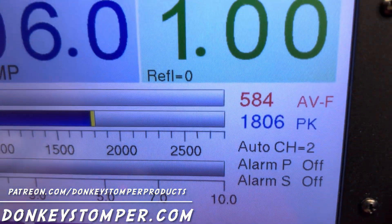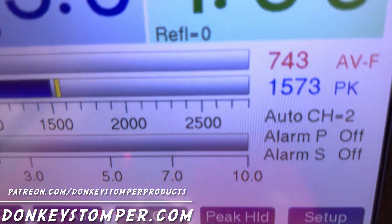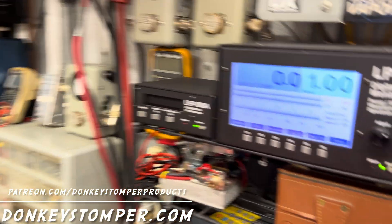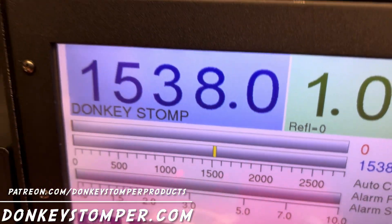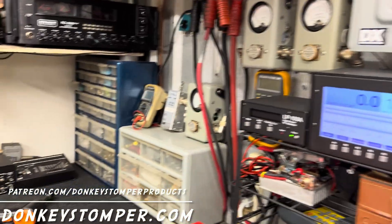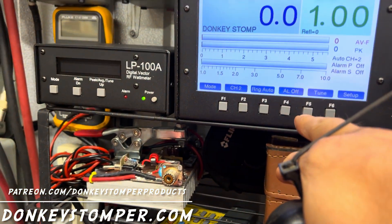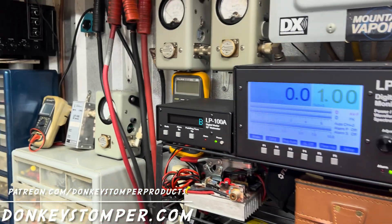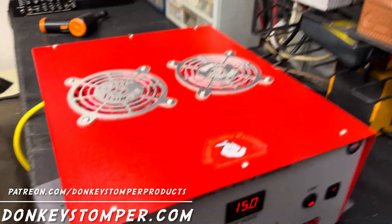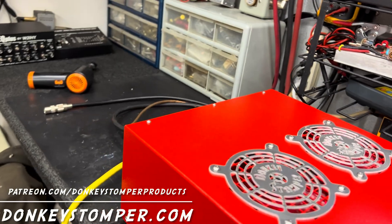So let's do it again — we're on AM, about 800 average. Just flip it to sideband — see that spike? That's what's killing them right there. So guys: if you do 700 average on AM normally, when you're set right with your carrier at 25 watts per transistor and you're doing 700 average on AM, when you go to sideband you drop down to 500 average.